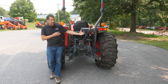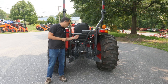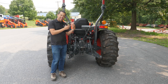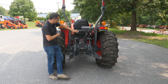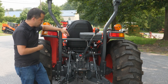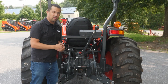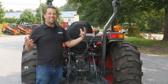A machine like this very clearly should be capable of more than that. You need to get more than 15 horsepower off of this big tractor down to your implements to do some work. You're going to find that the PTO is going to be the place to do that. When you have spinning shafts directly connected to your engine, you're much more efficiently moving that power off the engine and out to your implements. While you're at 60 horsepower at the engine of a tractor like this, you're around 51 and change coming off the shaft at the PTO. If you were looking for a snowblower setup on a tractor like this, the right way to do that would be to run the PTO. There are several companies that make front mount snowblowers for tractors like this that feed power off the back, drop it down, and send it out to the front of the machine. By using a setup like that, you could run that same snowblower out front but with nearly three times the horsepower.